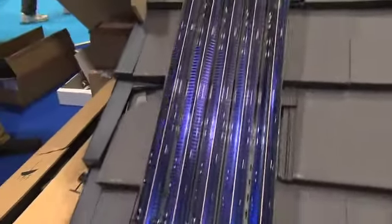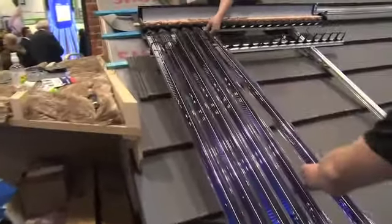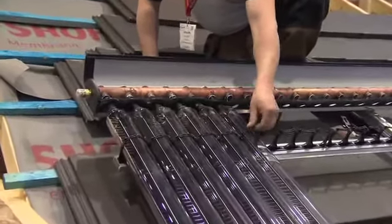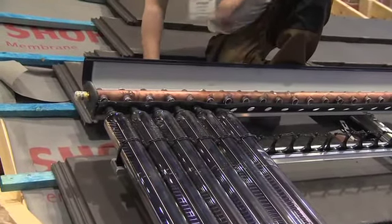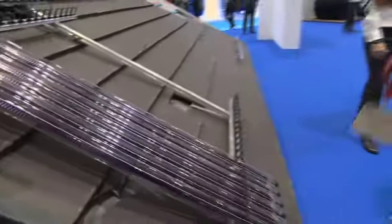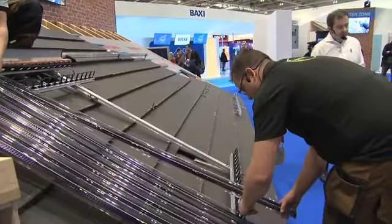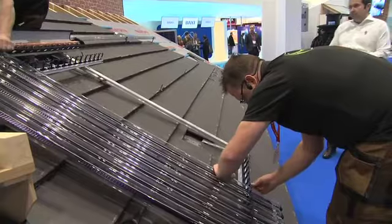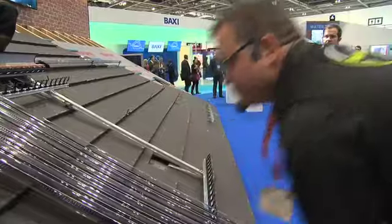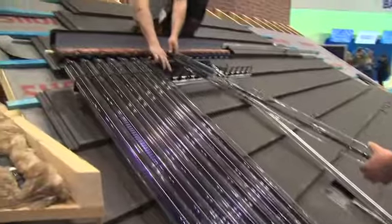That's right. In terms of where you can put these on the roof and the sort of roof you need, again, is there an issue about the pitch of the roof and where it's facing? Can it work on all sizes, all types, all shapes? Basically what we do is with the heat pipe, we have to install them between 20 and 70 degrees because obviously, as you know, heat rises. So it actually rises up in the tube to the limiter at the top and then transfers the heat in the dry pocket at the top. Now, as a company, we also do the direct flow system. So we could actually fit those between 90 and 0 degrees. Right. Because it's actually forcing through. So we have got an option for either.